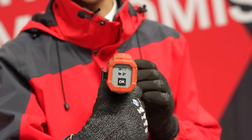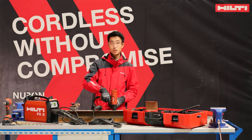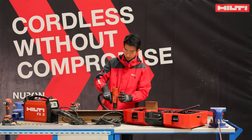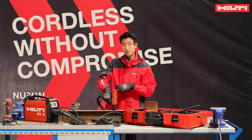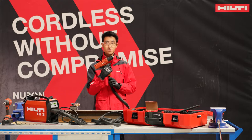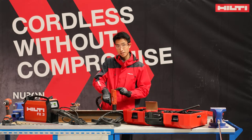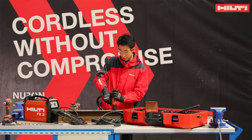On this welding gun there are two green lights. Without detecting a proper connection, you will not see two green lights — it's only when you're connected to a well-connected surface where a closed circuit is detected that you see two green lights, and that's when you can weld. If there's only one green light and you press the trigger, nothing happens. It's only when you have the complete circuit that the two green lights turn on, and when you pull the trigger the stud welding will happen.